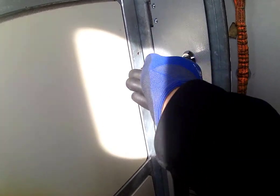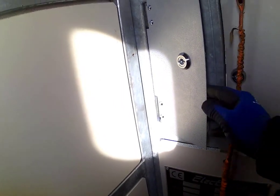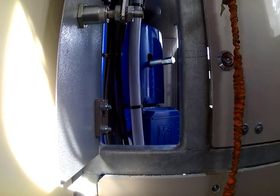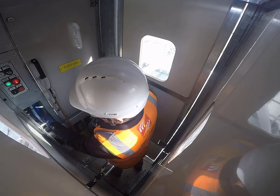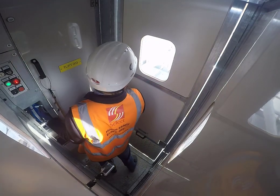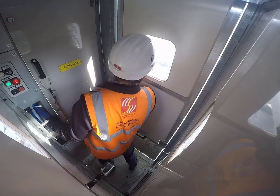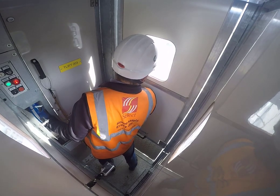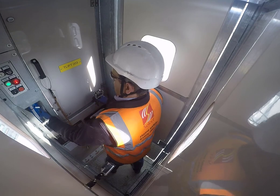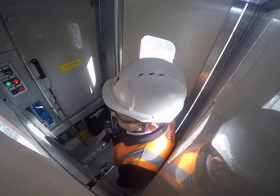Use the panel key to open the small door which is below the control panel. Inside you'll see the lever for the brake release. By raising this very carefully, the lift will start to lower itself. You need to be gentle and controlled. The lift should only go down slowly — if you go too fast you will fire the emergency brakes and no further lowering will be possible.